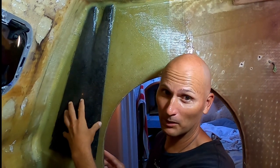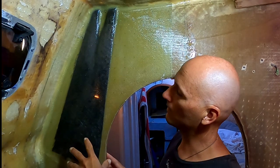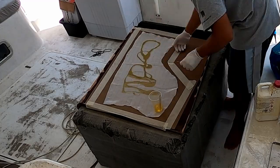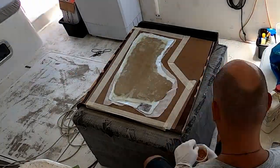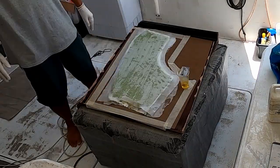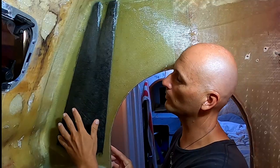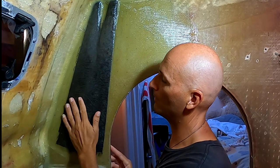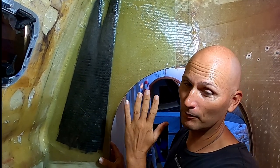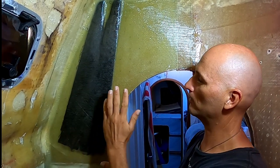Carbon fiber — the black magic — is super strong and makes our world a pretty amazing place. What I've done is this black carbon fiber has been stuck to the bulkhead here. This bulkhead you would have seen I had e-glass double bias on there. People asked why I used e-glass and not carbon, but we'll get onto that later. That created a bed for me to bond into, and most importantly the carbon fiber is bonded to the e-glass double bias that was on the foam.